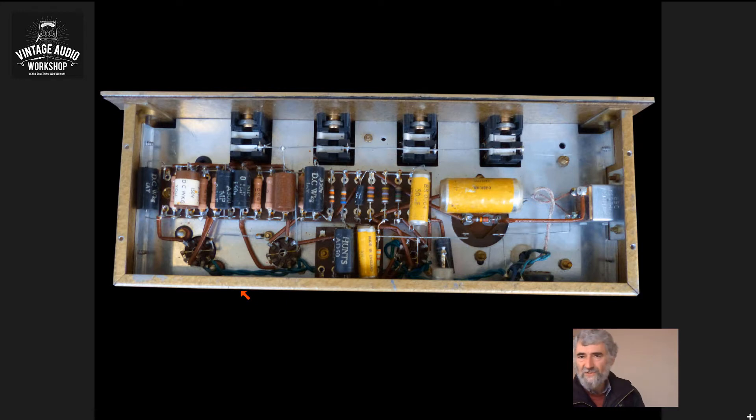I don't associate Stern — and I'm not saying this in any rude way — but they were mainly for hobbyists and did lots of kits, so I wouldn't have been surprised if there was a mess under this chassis. In fact we find two things: firstly, it is very nicely built; and secondly, they have used high quality components. As pointed out in the Mullard circuit, it specified high-stab resistors. You can see the pink resistors here — these are carbon film high-stab resistors, military grade. So where it matters they've used good resistors. Elsewhere they've used ordinary carbon composition resistors, which depending on the maker may still be good or hopeless; if replacing them nowadays they'll be metal film and therefore low noise.